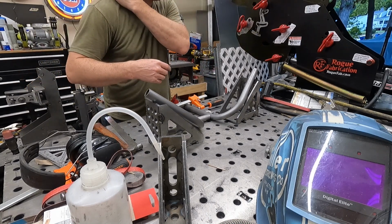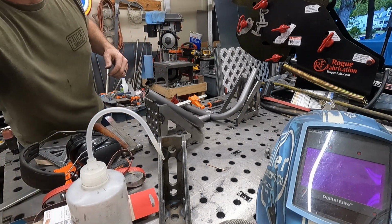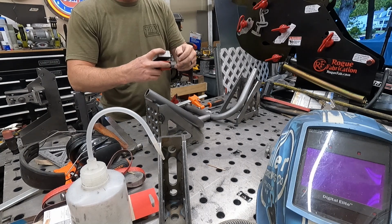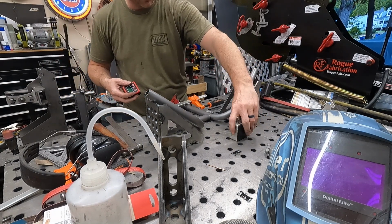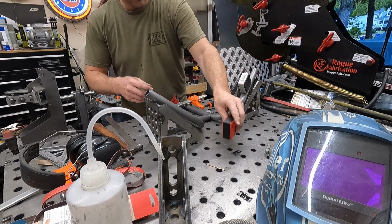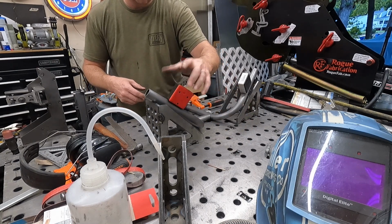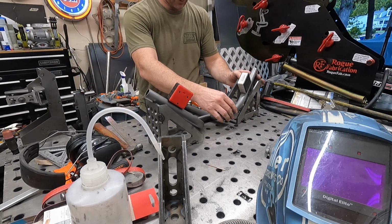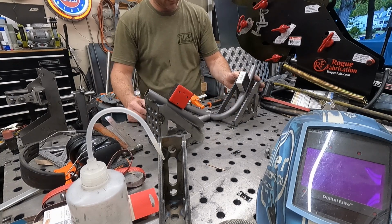All right, now we gotta get our angle. We got these guys here. So put it on the table, zero it out. Put one on here in line. Put one on here. Zero it out, put it on here. And then we're gonna go to 44.5 degrees because the other ones were.